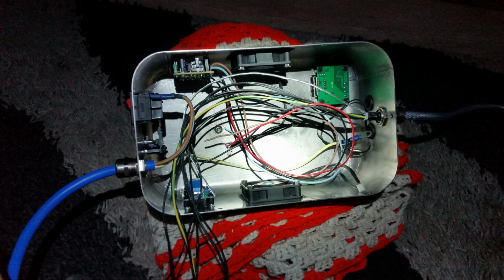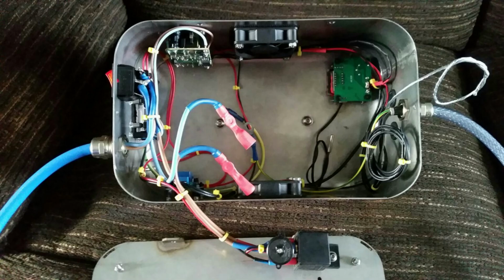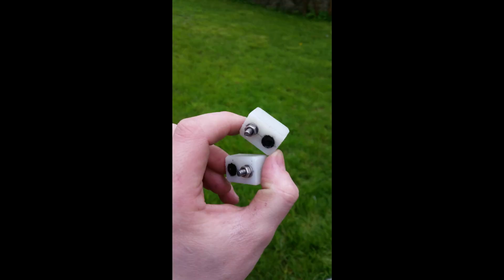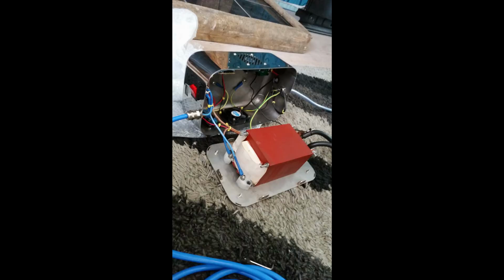At this time there were clamps for the switch, but they were no good, so the wires were soldered on instead. Two insulating blocks for the primary end of the transformer, filled with epoxy around the caps, so two screws have no continuity between them on each block. This is it all wired for the cover ready to go on.